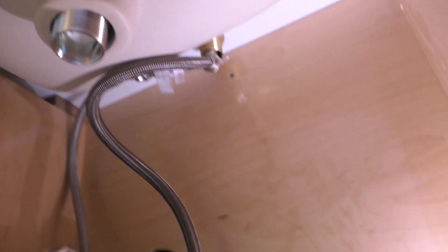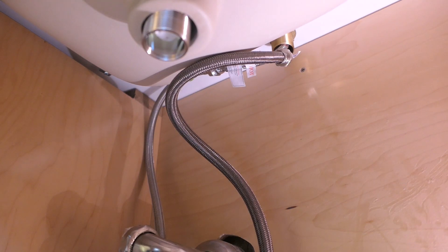For this pop-up, we don't have to put any plumber's putty because it came with its own washer. I love these clicking pop-ups just because we don't have to put the rod and that whole entire assembly in — I just feel like they work so much better and have less problems. So put the washer on and then this little piece of plastic.